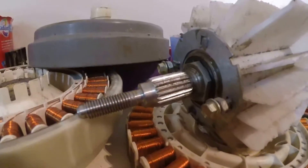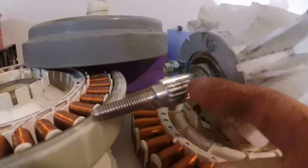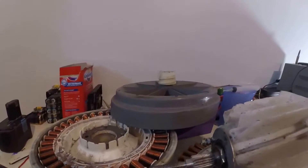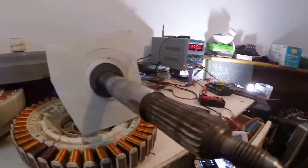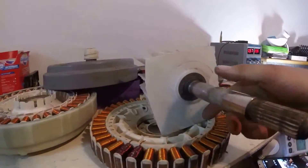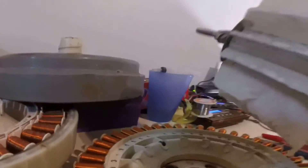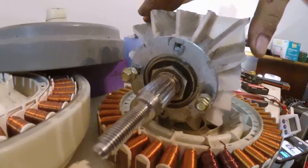This is the standard centerpiece that's in the washing machine — this side is where your motor bolts up, and this piece here is where your agitator goes on. You've got a water seal and two good bearings. All I've got to do is borrow someone's lathe, put this shaft in the lathe, and turn it — I'll probably hold it from this mount, put that in the chuck, and then just turn down this until I get down to the tube inside.